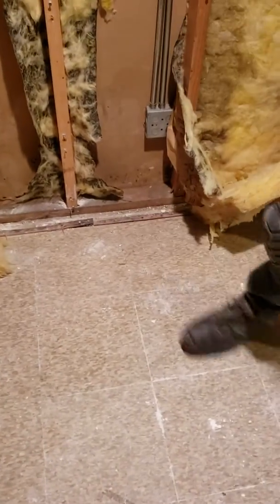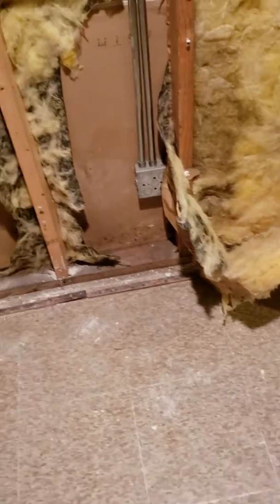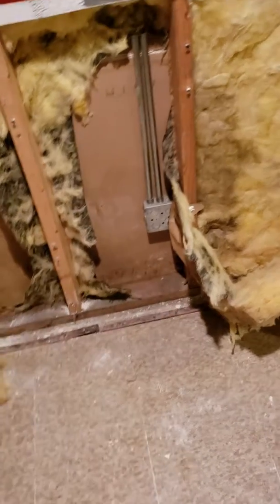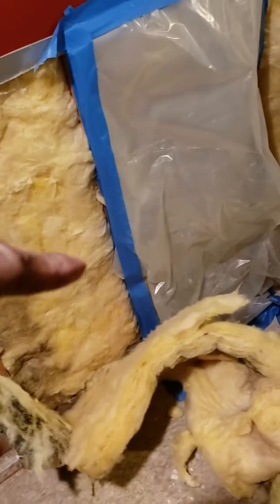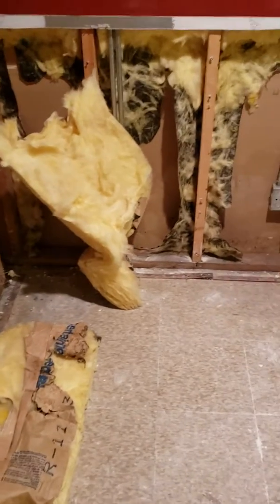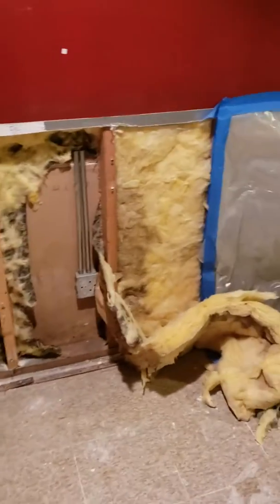The insulation is in there — we're gonna take the insulation out. It's still drying because it's wicking up. The reason why it's wicking up even with the drying equipment is that on the other side of this wall is another unit, and there's carpet that's still down there wicking moisture. That carpet needs to come up at this point. This is the south wall.